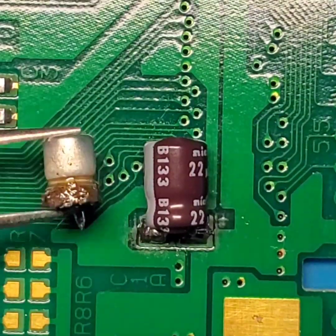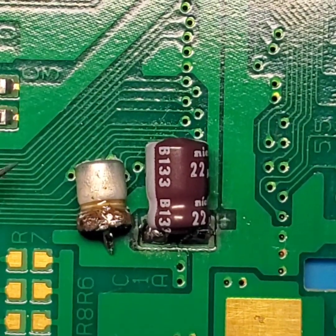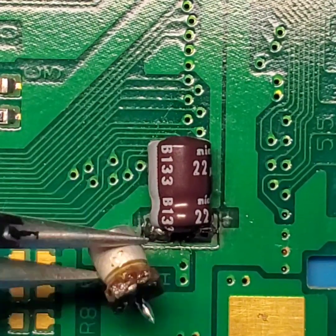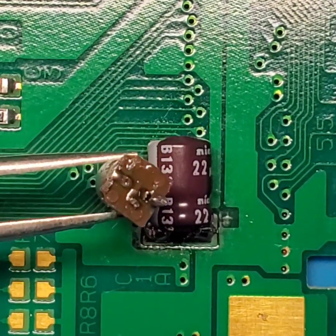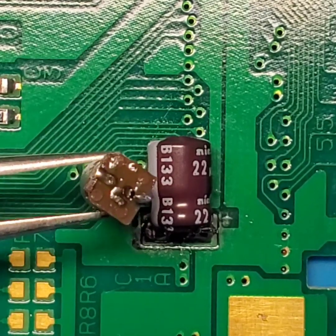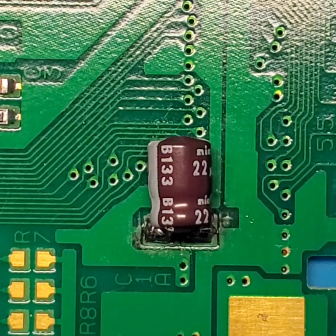And here is the SMD capacitor that we took off. So that capacitor is actually not too much smaller than the one we replaced it with, and I'll go ahead and show you the bottom, and that thing looks horrible. So that's what electrolytic fluid will do to the bottom side of a capacitor after it leaks out. Just eats it all up. Now all we get to do is take this cart, put it all back together, and she's ready to use.